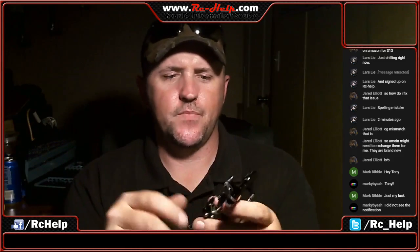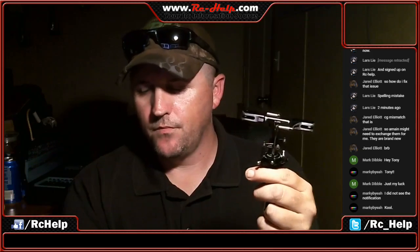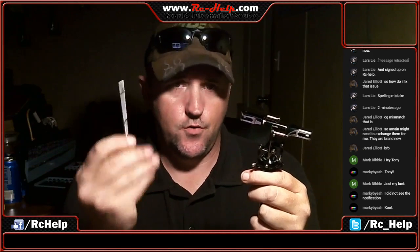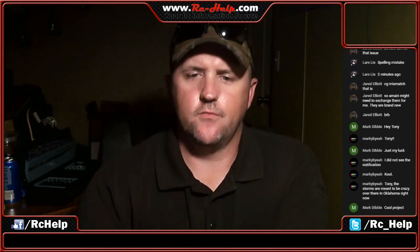So what we did today is we drilled out where the main shaft goes, because the main shaft wouldn't go far enough up in there. We drilled that out to 5 millimeters, and then we drilled another 2 millimeter hole 8 millimeters above the original hole, which lowered the head down 8 millimeters. Then, for S&Gs, I grabbed a DFC main shaft and put it collar to collar, and it just so happens the DFC main shaft's hole is 8 millimeters lower, which would have done the same thing without drilling a new hole. Go figure. So we're learning stuff.